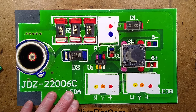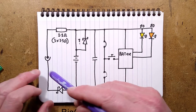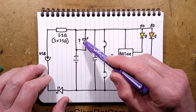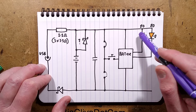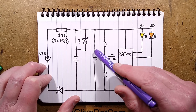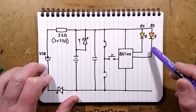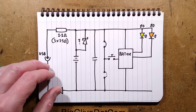Let's take a look at the schematic, which is more or less as I've just said. There's the incoming USB supply, the 1.1 ohm resistor, and the battery pack. One reason they might have put the diode there was to protect against reverse charging the batteries, but also the batteries were already such a low voltage it may have caused issues with the LEDs. At some point the diode has been bypassed and just left in the circuit board. There's a little decoupling capacitor for stability, the optional link for the button going to positive, and then the two sets of 80 LEDs - that's 40 of each color on each side - going to the chip.